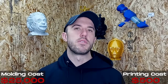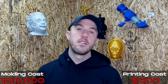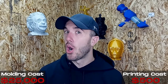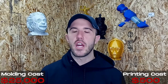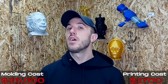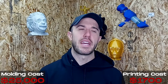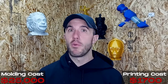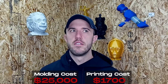Especially if you're making a part that is so geometrically complex that it is difficult to mold but absolutely easy to 3D print. If you go ahead and order 10,000 parts with 3D printing, you're down to something that's probably about 10 to 25 percent more expensive per part than molding. So if it costs 10 cents to mold, it's going to cost 12 cents to 3D print — but now you don't have the mold cost. You can order a thousand every month, make a deal with the manufacturer, and never have to store anything in a warehouse.